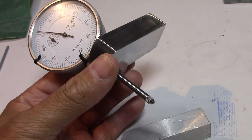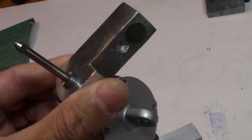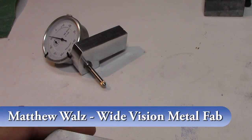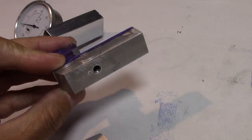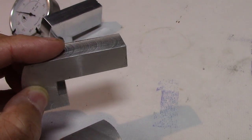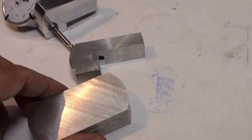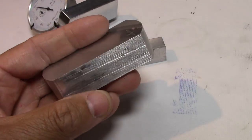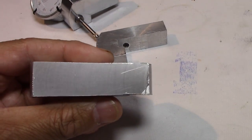I love my pop can dial indicator holder that's magnetic, but in an effort to try to make it a little bit better, I kind of screwed it up a little bit on the bottom with milling it. So I decided to make another one that wasn't just magnetic, but had some mechanical properties like Matthew has on his. I start off with the same pop can aluminum, milled it, and made this with a set screw on the top. It hooks on the bottom of the bedway, and when this pushes on it, it gives a little bit of a rise. So I thought I'd make another one with a set screw going down on the bed rail. I cut this out, started milling it, and thought maybe some guys would like to see this. So let's do some machining on it — I only did this one side with a fly cutter.